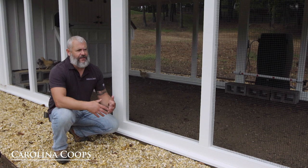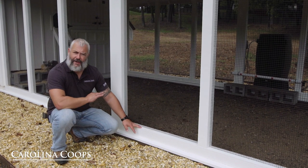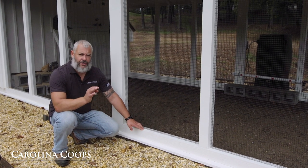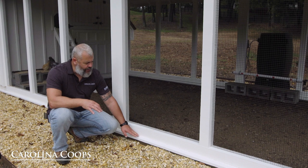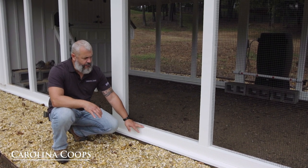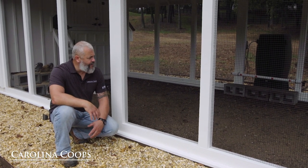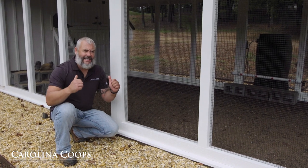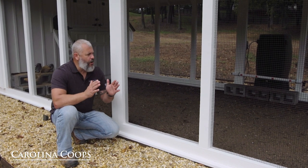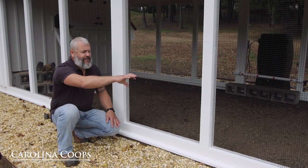Do we put down a base? You do not have to put down a base. All our coops — no matter if it's custom, craftsman, Carolina, or Cali — everything on the bottom is pressure treated lumber. You have to have that because that's where you're going to have that constant battle between wet and dry, and that's what feeds the wood destroying organisms. By using pressure treated lumber, you eliminate that. In this particular situation, the customer went with the best case scenario: a solid slab underneath the henhouse and shed area, with a perimeter of concrete about six inches wide — one big giant rectangle.